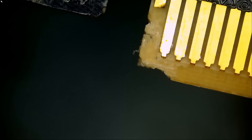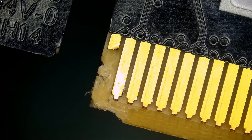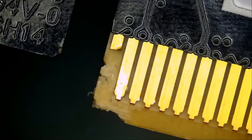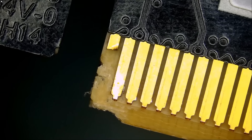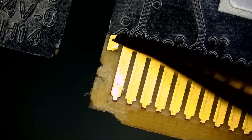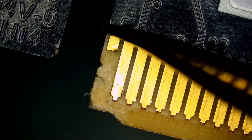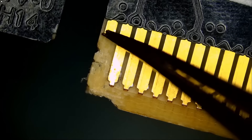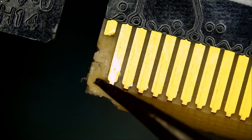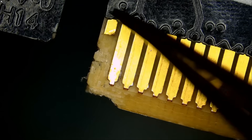This type of damage is really tricky. We do not know how the pins will behave when you insert that card in the PCIe slot, but we're going to do our best. For this one, we still have a tiny piece of pad left on top, so we know that piece is making a connection with the wire going somewhere within the layers of the board or somewhere on the back. Instead of running a wire — because a long wire will probably break when we insert the card from the bottom — we need a different approach.